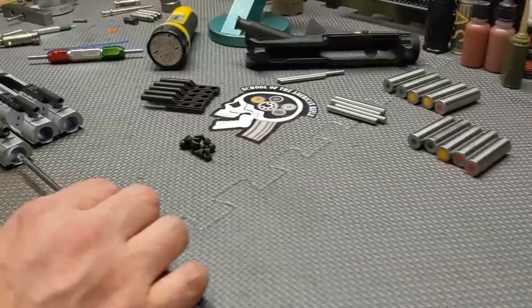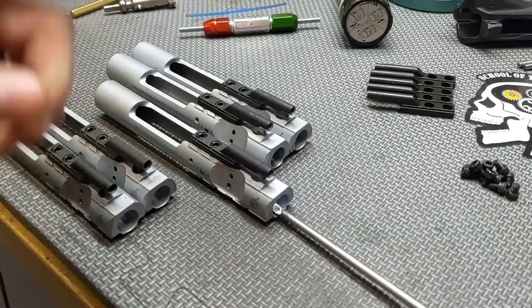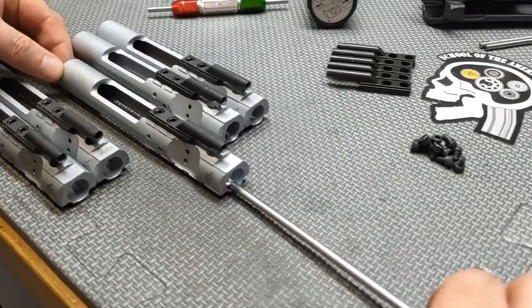Let's go to the bolt tail run now. I'm running into a wall here, and there we go. This one is not as clean. You can see some machining marks. Not terrible. And that one doesn't look too good right there. The overall finish of that area is the least important, though. The area that can be critical when it has to be smooth is the second run or the gas ring run. That is what interfaces with the gas rings, and having a rough bore in the middle here can cause accelerated gas ring wear. So we'll get into our third one now.